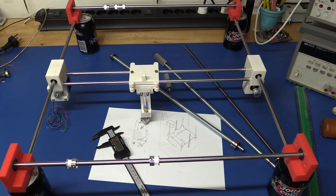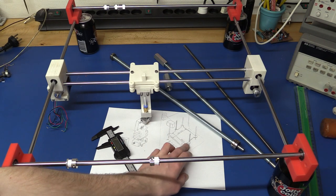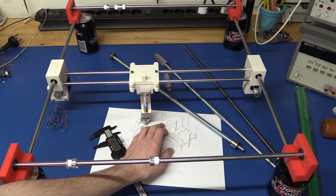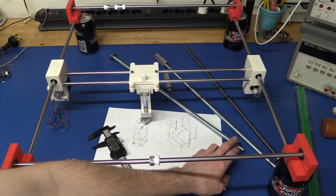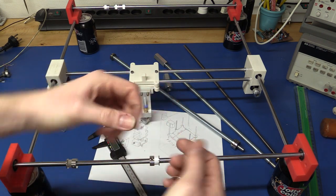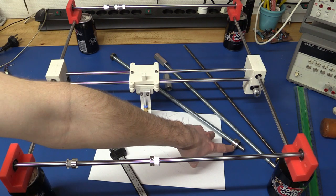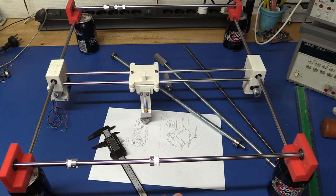So I think that was pretty much it for this video. Now I will have to wait for the glass plate to arrive, and I'll have to make some brackets, both to hold the build plate here, but also to hold the shafts fixed against the case or the box. And also some that will take the bearings for the threaded rods here. And I'll probably have to make these so that I can make them like a clamp, so I can put a bolt through and tighten them up, because I will need to get the shaft out of the other end, as you see here. These ones I didn't have to have a hole in the back, so I don't really have to make a clamp for those.